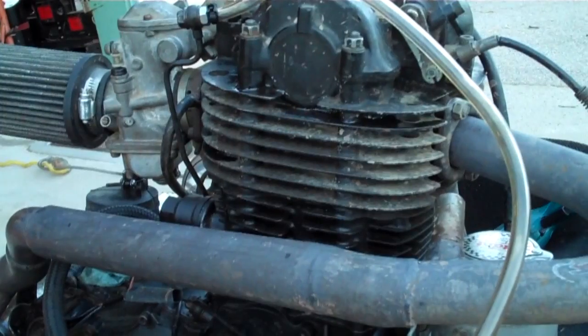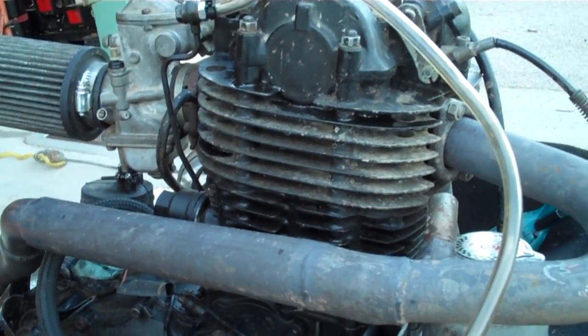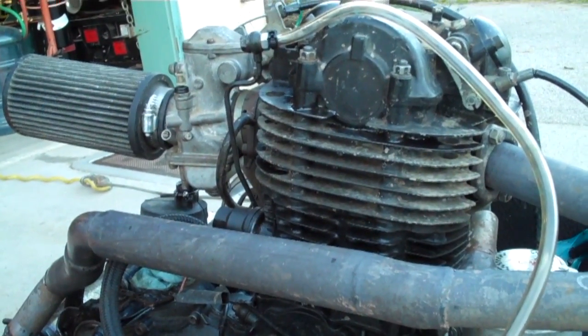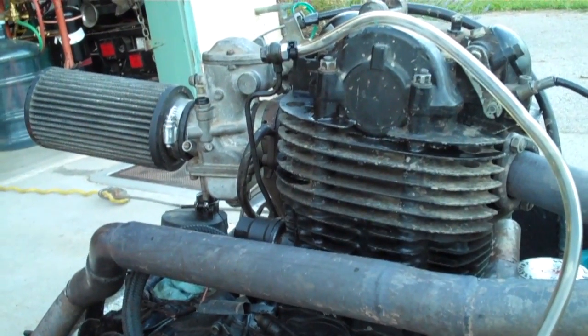The other reason I ran this line off the cam pressure fitting into a quart container is to eliminate any oil that's up in the cam area, to see if maybe I had an intake or exhaust valve guide leak. But running in this configuration I didn't notice any difference — I'm still getting a lot of oil burning out of the tailpipe.